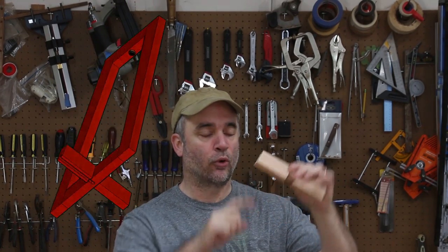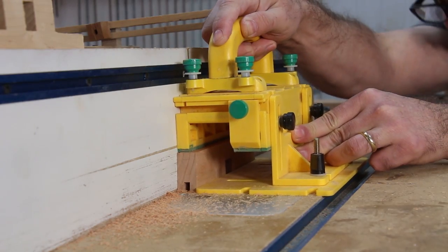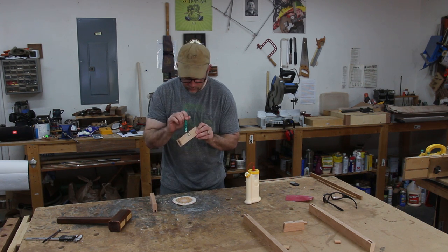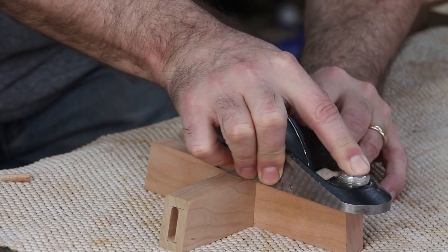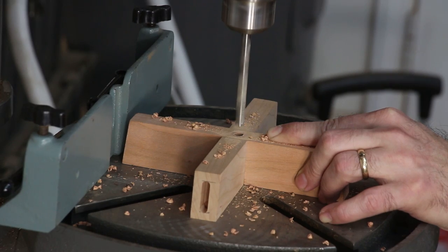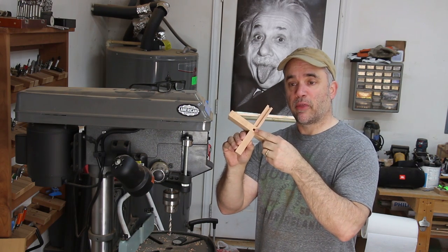I need to make a slot in the bottom of the support foot for the lamp cord to come out, and I'm going to do that with a quarter-inch spiral bit in two passes — on the second pass I'm going to raise the height of the bit. Now I can glue the foot to the bottom rail. This hole I just made is where the lamp cord will exit out of the bottom of the lamp. The next thing I need to do is make a connection between the hole in the bottom of the lamp and this channel for the lamp cord.